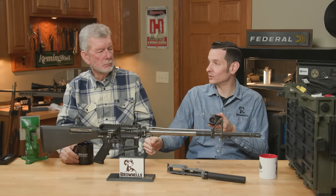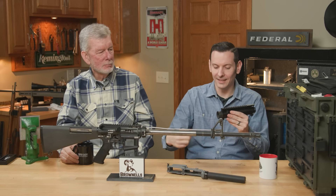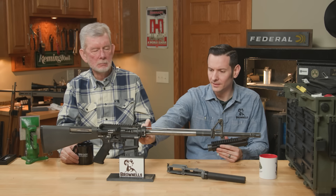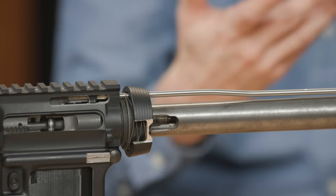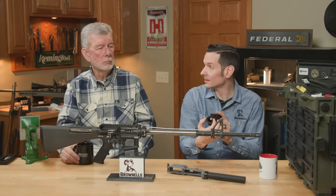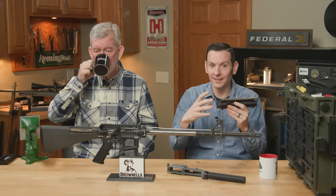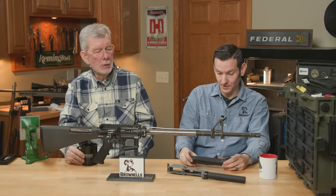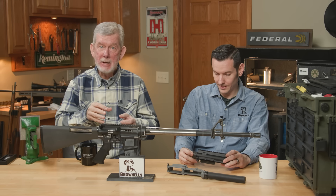What's the closest tool that cuts here? That's the Dremel tool. So let me get that Dremel tool out — that wheel will fit right perfect on that radius, and I can just remove that tooth, and that gas tube will go right through there. I've seen that so many times, especially before free-float handguard barrel nuts that didn't have to index were a thing. Other manufacturers make barrel nuts, and the worst part is whenever they put handguards on that have to index on these slots here — like the old Samson ones — if you grind that slot off and go to slide your handguard on, it's not going to index where it needs to. So now you have a handguard that's crooked — the gap tooth installation. And once in a while, the clever person will take that thing off to grind the tooth and get the wrong tooth, and you have to go back and get another one.